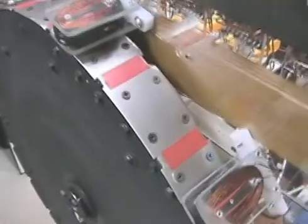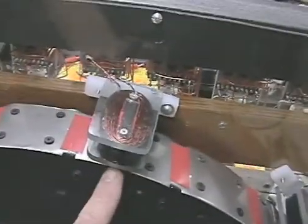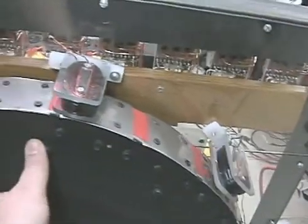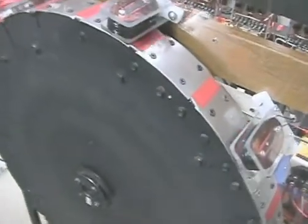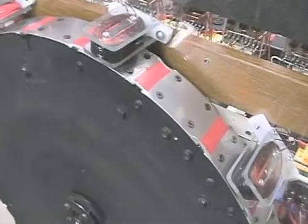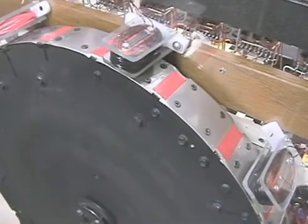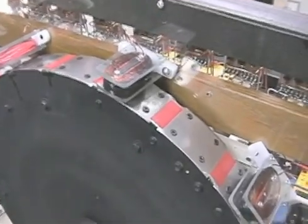Every coil on the motor has its own trigger. So each coil has its own trigger point and they are in sequence. When they fire, they fire sequentially — as one passes, the next one fires and they're progressive. So the push is more constant as opposed to a pulse. With the original VMG the circuit only pulsed once, but here each one pulses separately, so it's a continuous pulsed circuit.